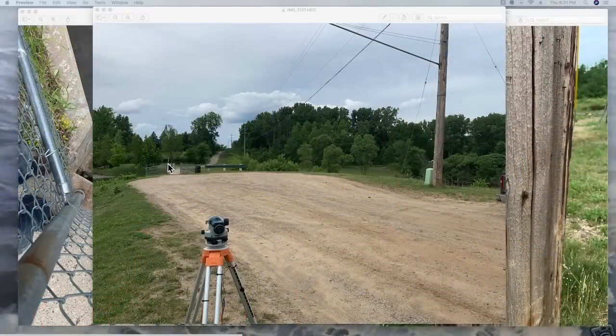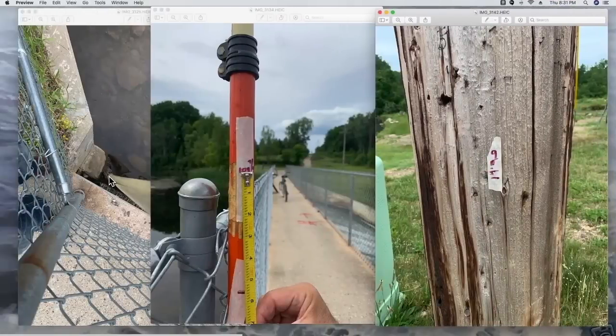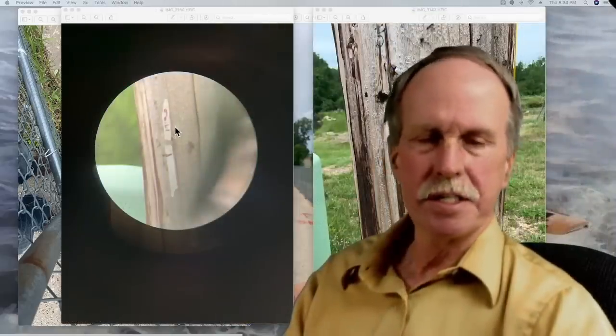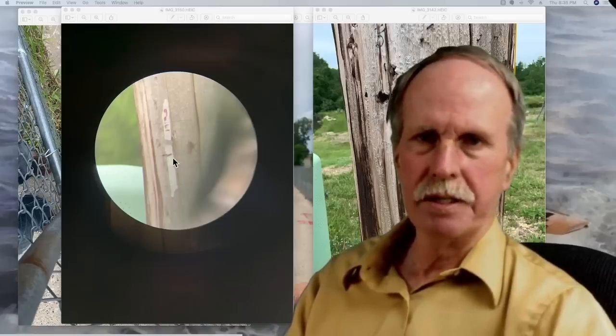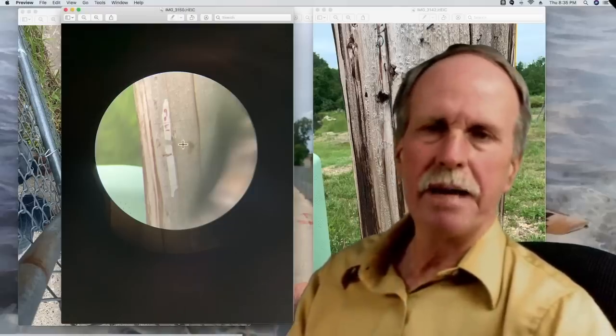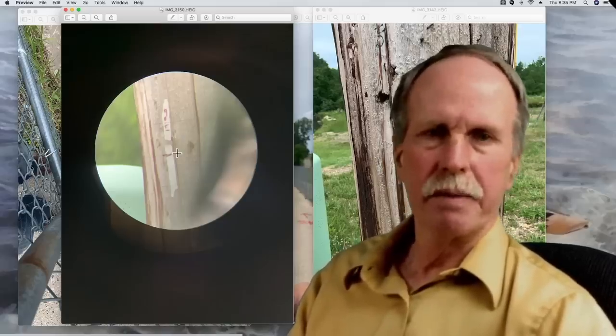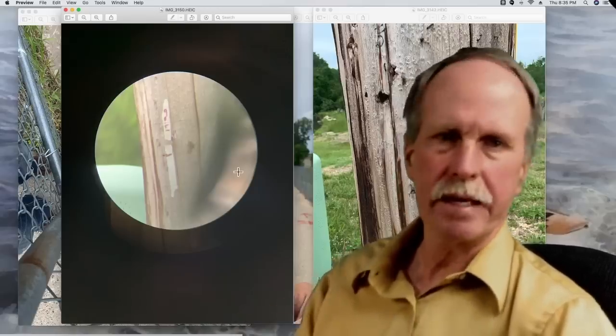Here is the dam and I've got my pole right at the side of the dam. Here is the light pole and here is the charter cable box. I measured the distance from the surface of the water and then translated it over to the light pole - that's 96.5 inches. Once I had the reference distance on the light pole, I could look through the auto level and line up the top of the cable box, then bring that over and find out exactly where that is on the light pole, giving me an elevation above lake level for the top of that cable box.